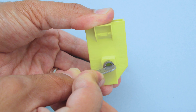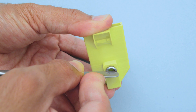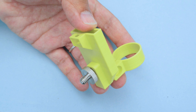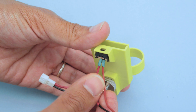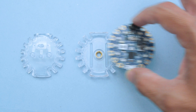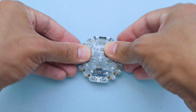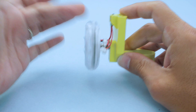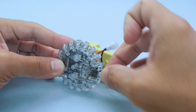The tripod screw adapter is secured to the mount and features a threaded hole for screwing into a quarter-twenty screw. The adapter is used to attach to the clear case. The slide switch is press-fitted into the built-in holder right behind the battery. The clear case for the Circuit Playground is designed to snap fit and features a built-in slide switch and buttons. The case attaches to the tripod screw and easily connects to the JST adapter on the slide switch.